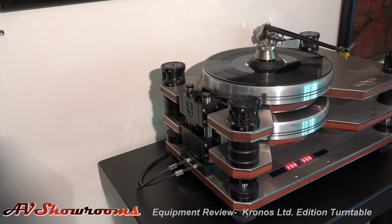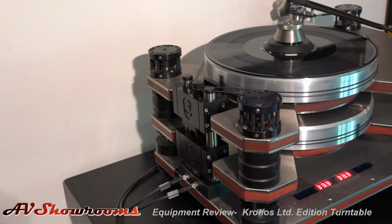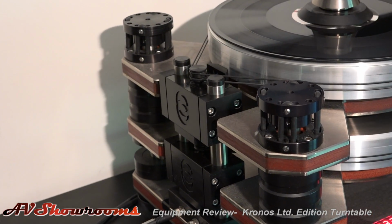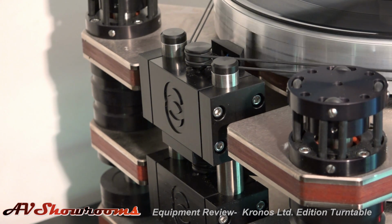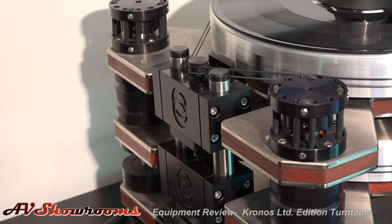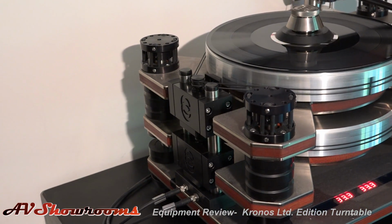The motors are by Maxon from Switzerland. They're a brushed DC design. Now, brush motors are very good for RF rejection and really good for reducing the back EMF, but have a drawback. The brushes make contact with the armature of the motor. You will hear that. Mr. Desjardins' first set of motors from Maxon, you could hear. Then you get 2 feet away, you can no longer hear the brushes on the motors.